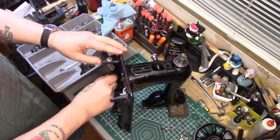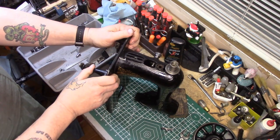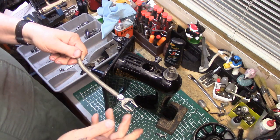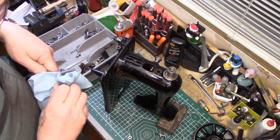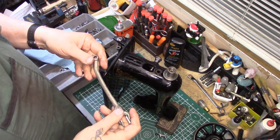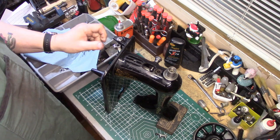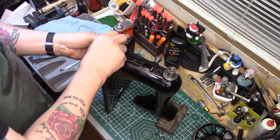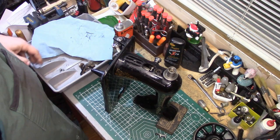This has got way too much end play on it at this point, so it's in — two screws, it's not adjusted. First thing we're going to do is take the fork for the stitch length regulator. I'm just going to wipe this down; it's got a little too much oil on it. Everything has been cleaned. I'll drop the bolt in but won't put the nut on just yet — just getting the bolt in there a little bit with the adjusting screw going into the machine.